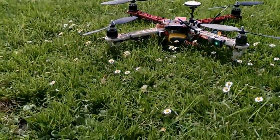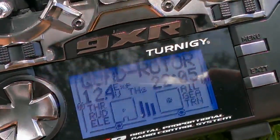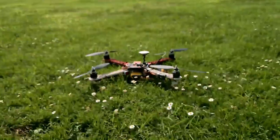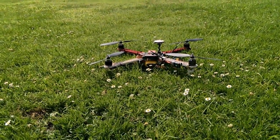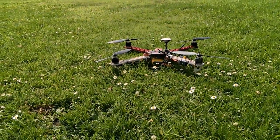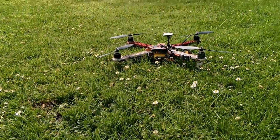We've reached the final voltage — 10.4, 10.5 — at 22 minutes. I'm not really disappointed. I figured I'd get somewhere in the 20s with these two batteries hooked up together like that. It is a lot of weight. If I were to get lower KV motors and bigger props on here, I know I can get nearly 30 minutes with this setup.